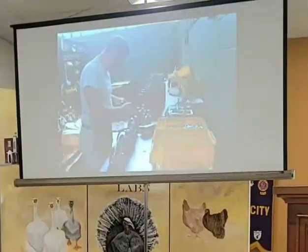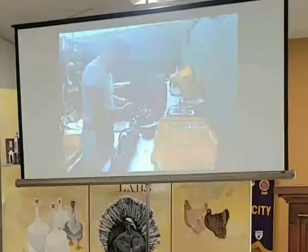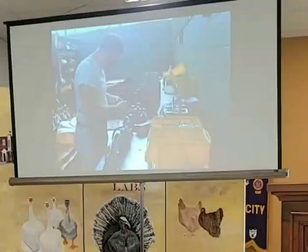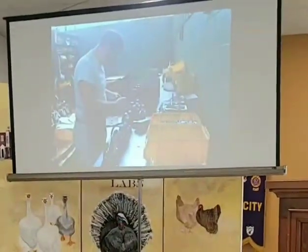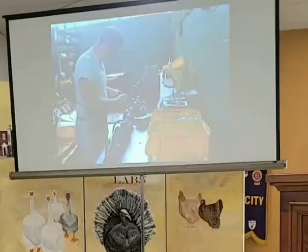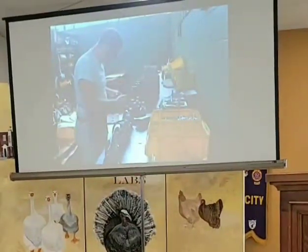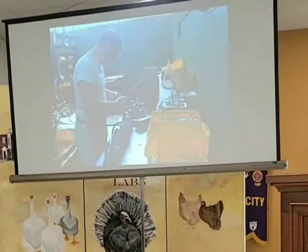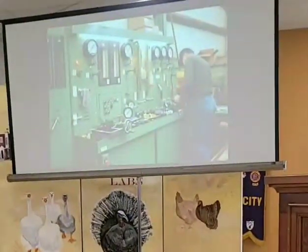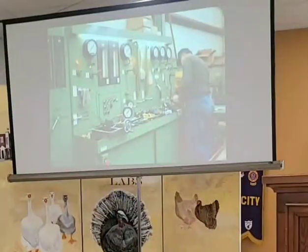This is an irrigation engine on test. Every engine once assembled went through a series of tests, and we had two test cells running basically 24/7. Another part of the assembly line was a clean room where the power shift transmission — called the over-under — was put together and tested before it ever left. Sub-assemblies went into it and hydraulic components were all tested before going to the assembly line.